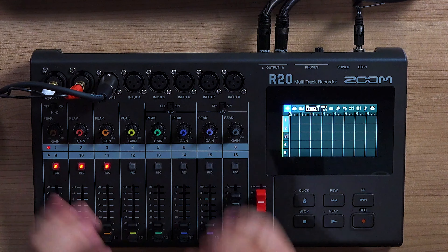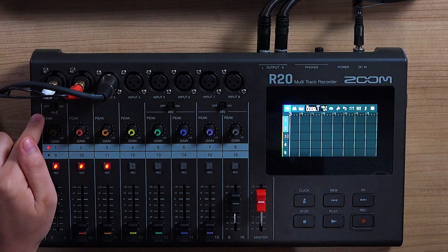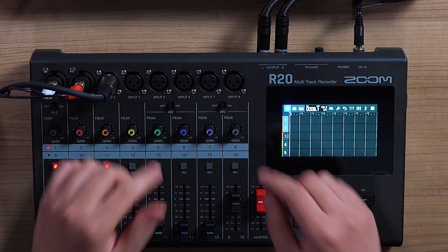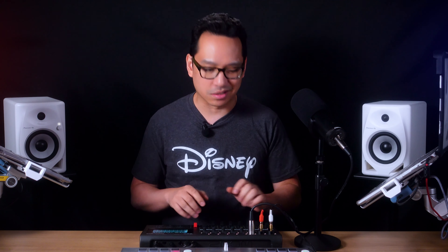In a nutshell, the R20 is a 16-track multi-track recorder with eight individual inputs. Two of them are combo XLR/TRS with one having a high-Z input for your guitar, and then you have six XLR inputs on the others. You get two pairs of 48-volt phantom power if you need to run a condenser mic — that's eight inputs you can record simultaneously, more than enough for a full drum set. That's the multi-track interface mode, but you can switch it to audio interface mode, which can give you either two stereo inputs going into the computer or eight individual inputs going into the computer, and you can use it with your favorite DAW.